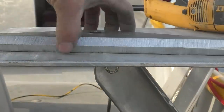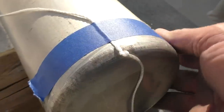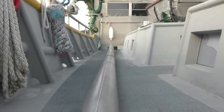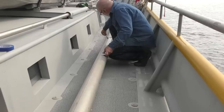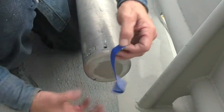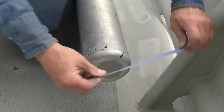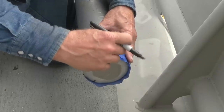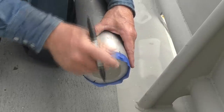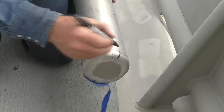The bevel will help it get welded back on with a lot of penetration underneath it. I've got a straight line more or less down the pipe. I'm using painters tape to find halfway around the pipe, so I try and get these two lines opposite of each other - two marks on that line. Painters tape is really handy. There are my two marks - they happen to line up perfectly. If they didn't I'd just split the difference.